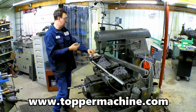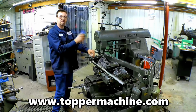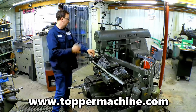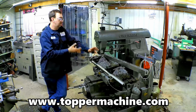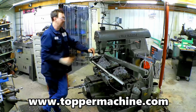This one, in fact, we took 7/8 of an inch depth of cut, inch wide cutter, 33 RPM, 1 1/4 inch a minute feed rate. And it cut beautifully. Did an excellent job on this. So you've got to find the ways to utilize the equipment you have, or get creative. Play with it. Feel the machine as it's running.